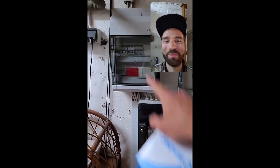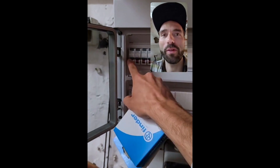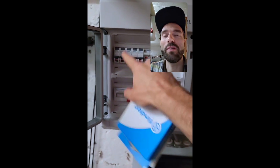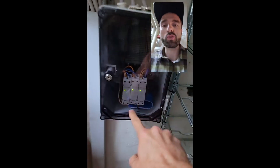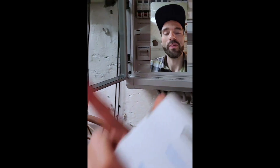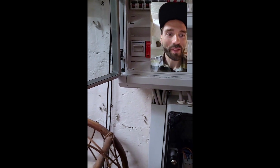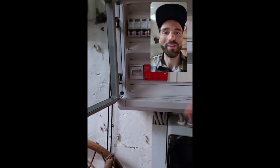My machine room is basically just this. As you can see, here are the general fuses for all the different phases I have in my room — this one is for the computers, this is for the AC, and then these three are for three different types of gear in my studio. I can switch those on with the levers, and those levers control the electronic relays. They make sure that when I switch on the electricity, it switches on at the zero crossing of the current, which is very helpful for switching power supplies with an inductive load — so your gear can live longer.